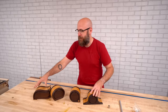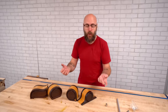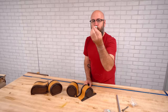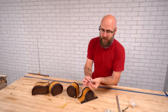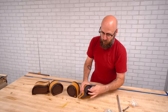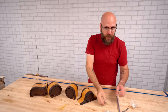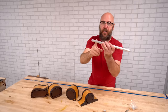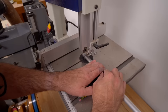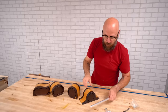The final step is to make a little drawer pull. You can make them out of wood, but I like the contrast you get with a store-bought drawer pull. I drill a hole and epoxy it in. I got these on Amazon, but they're not always available, so another option is to get a piece of aluminum rod and cut it down — you can cut it with a bandsaw or any woodworking tool, then glue it in and polish it to get the shine you want.